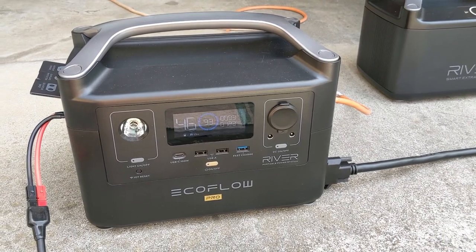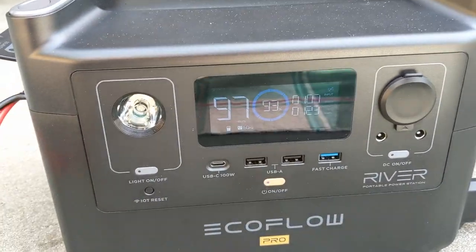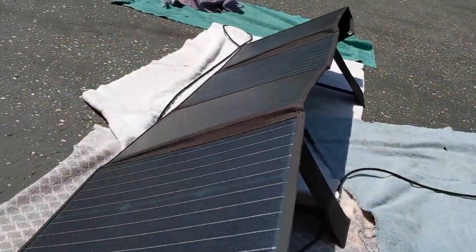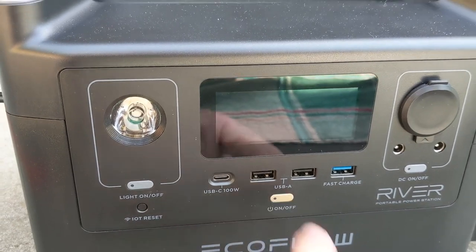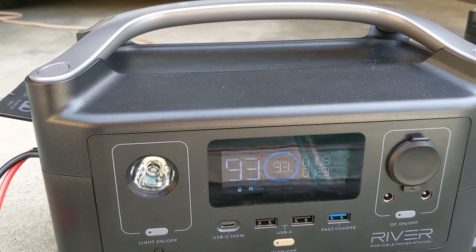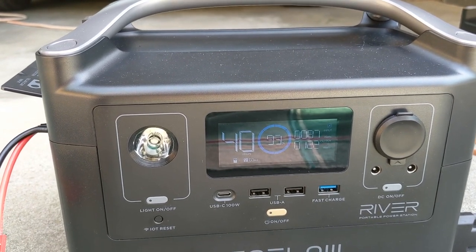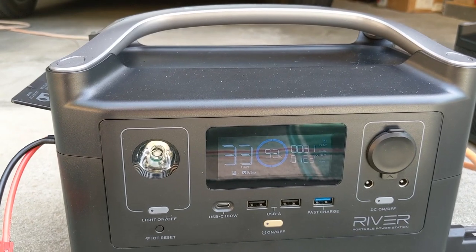It's been about three hours — I started at 11, it's now after 2. So far so good. I started at 99% and have dropped about 6%, so I'm around 93%. I figure there's another good three hours of sunlight. I've been positioning my solar panels toward the sun. I seem to be pegged at about 107 to 108 watts of input — it jumps around a bit. Quiet mode on or off doesn't seem to make much difference.